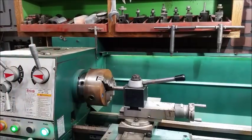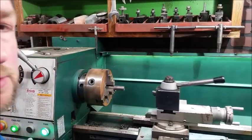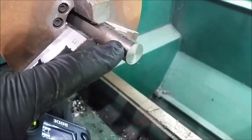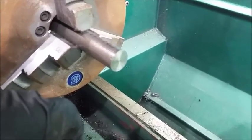It's too slow — let's do 800 RPM. That's not bad. That was a rough cut and it cut pretty darn smooth, except for a little bit of a line. So I'm just going to go to a trace cut again. I might just get away with cutting this a couple of passes and not even have to bother sanding.